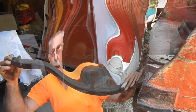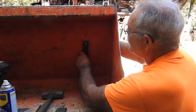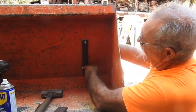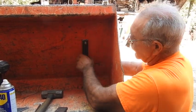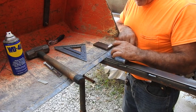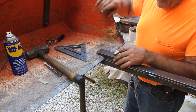Then we'll go back to the original plan. Put grade eight bolts in here and in here on the front of the bucket with that half-inch plate. I've got three-eighths grade eight bolts, and if I accidentally break those, we'll always go to a half-inch. That's going to minimize flex and extreme pressure to the small area the bolts go through, spreading all that twist and torque on the bucket. Now for the front attachment, I'm making a two-inch by two-inch square, drilling a hole right down through the center of both of these half-inch plate thicknesses, welding this plug on, and tapping that for three-quarter inch thread, then squishing this down with a five-eighths or three-quarter inch grade eight bolt.